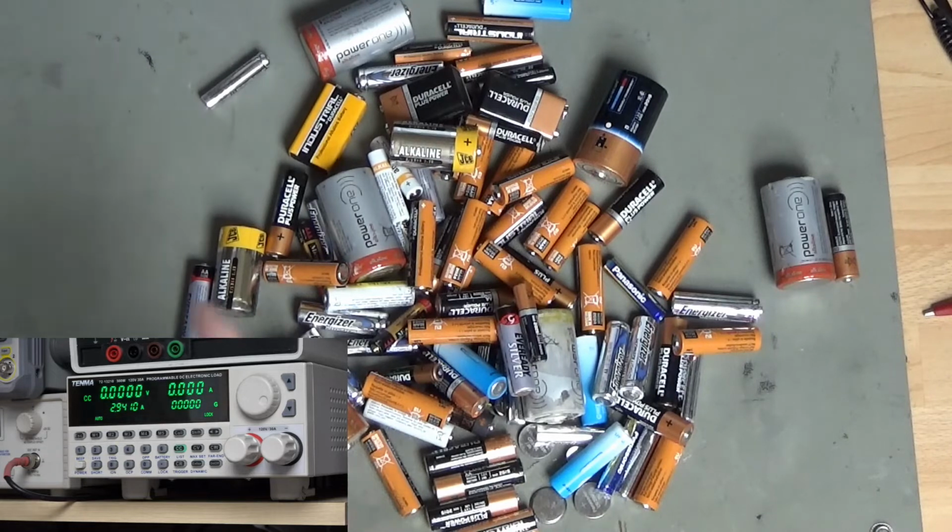So I'm actually just going to drain 2 of these batteries and measure what the actual current is, and so I'm going to drain them at 250 milliamps, which is quite a large drain for a battery. But for a lithium battery, one of the points with it is that you can deliver a large amount of current, much better than you can with an alkaline battery. So that's what I'm going to test them at, 250 milliamps, and one of the reasons for doing that is because that's the value they use in the Energizer Producer Handbook. And they illustrate it at 250 milliamps in that handbook, so that's what I'm going to use for my test.